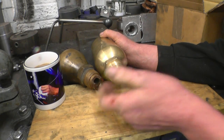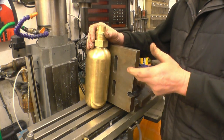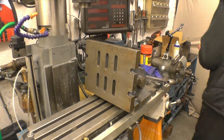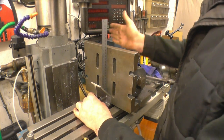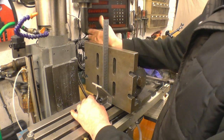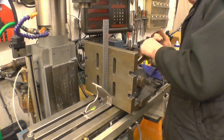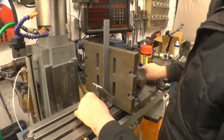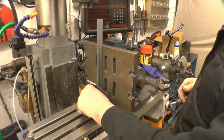I've got a milling cutter the same size as that — I'll be able to cut that hole out. I'm going to mount it and clamp it. This is just an angle bracket — a couple of bars through there and the centre piece across should hold it. This has been set at an angle for the last job I did, so it needs squaring up properly. Depending on what you're going to do you would normally want to clock it, running down that face, but for what this is it's pretty good as it is.